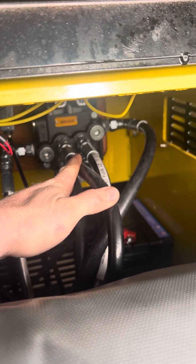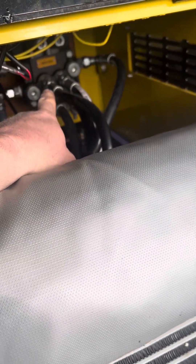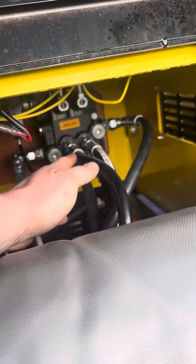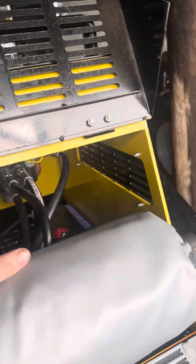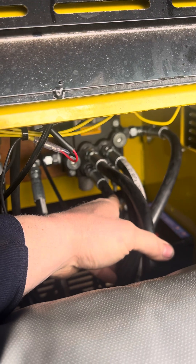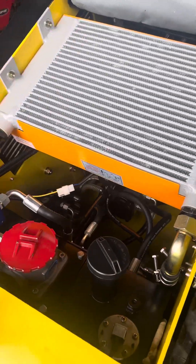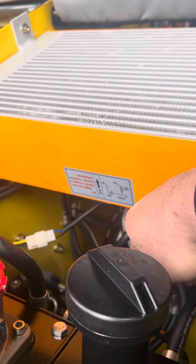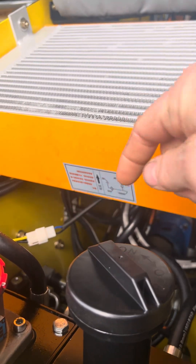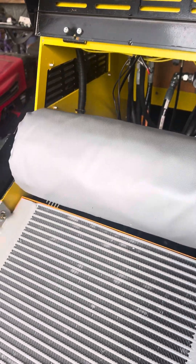These four lines are your wheel motor lines, and you will have already changed the fittings at the bottoms to accept the new number eight JIC fittings. This side of the valve is for one side of the unit and the other side is for the opposite side. The top line goes to the back side of the wheel motor, and the front side goes to the bottom. Just remember: top is back, bottom is front when you're looking from the front of the unit.